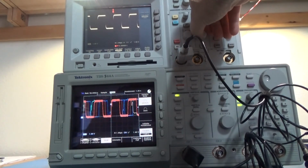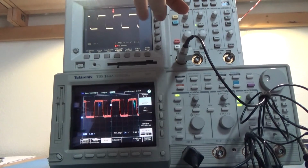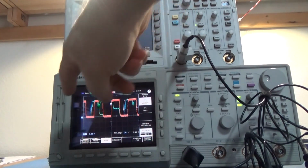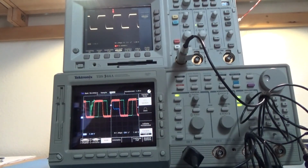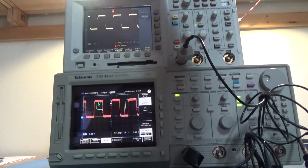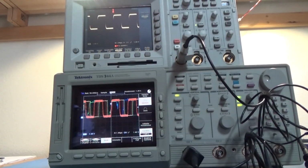waveform acquisition system, and presumably on both of these scopes, a waveform is 500 points from end to end of the graticule area, you know, then the various levels. So 500 samples. It's a kind of mystery point that most manufacturers really don't talk a lot about, what waveforms per second really means. I mean, is it little strips of what you're seeing, anywhere from what they're claiming, 100,000, 400,000 to a million, or is it 500 points, or is it 10,000 points across? Probably not 10,000, you can be assured.